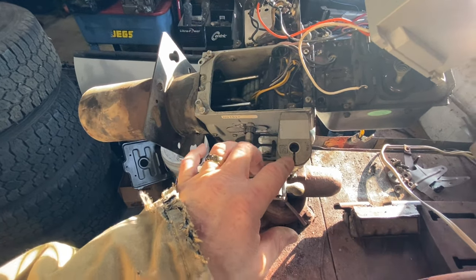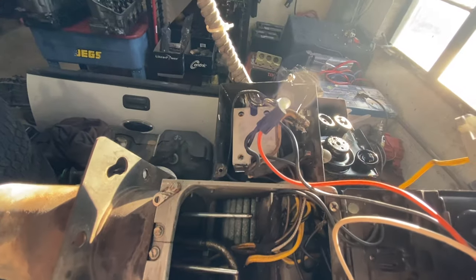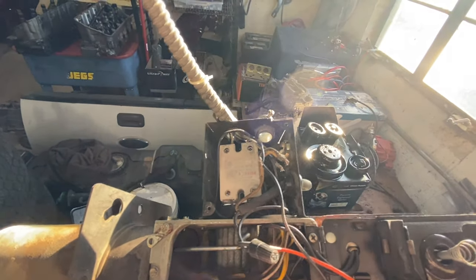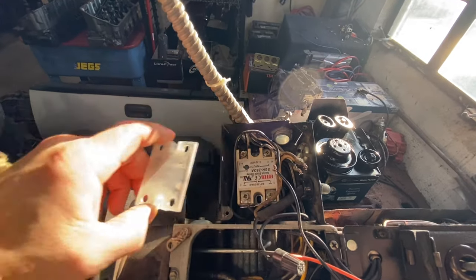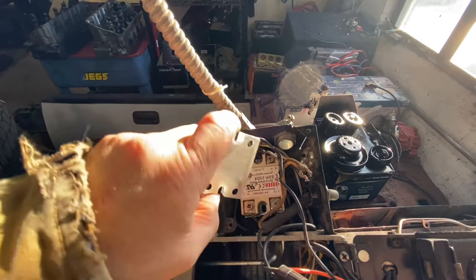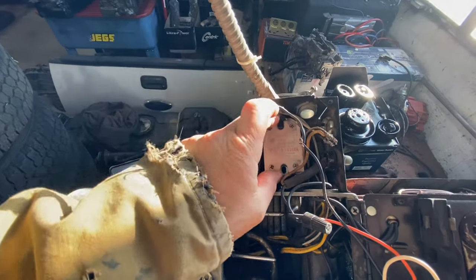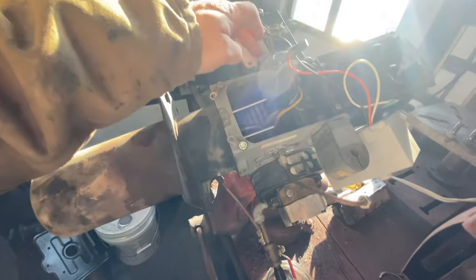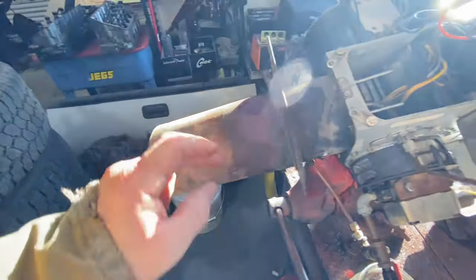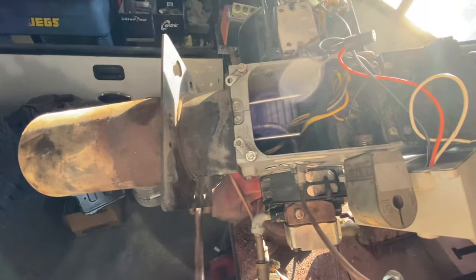In my scenario I have an uninsulated building so I run this quite a lot when I need it, and this solenoid gets a little hot running constantly. Over here - apologies for the mess, all the wires are out because I'm doing maintenance - right here is the relay controlled by your temperature box. It's basically got a probe and everything. This relay sends power to your heating unit inside the block. It feeds power to the actual heating element, which has a thermal coupler that goes back to a sensor block running all of this. I'll explain all that once we move to the unit assembled inside the heater.